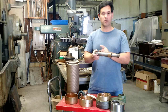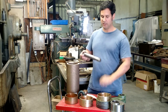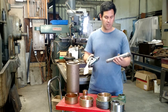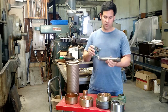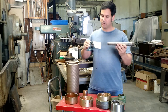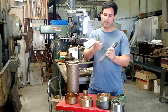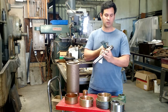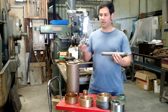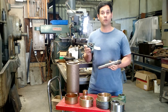These wear marks will actually cause this bearing to wear out prematurely. In a pillow-block bearing situation, all you would need to do to install this — because it is a self-aligning pillow-block bearing — is put it on the shaft and tighten it down. This flange right here acts as a thrust surface against the inside race of the bearing. So when it comes to installation, this is very simple and easy to install into your homemade lathe.